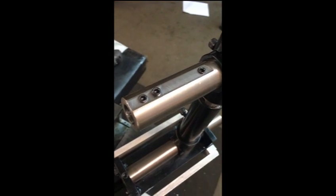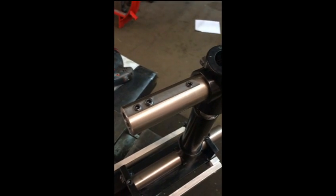That black dot is marked on the adapter, so the second screw holds the adapter in place. The other two screws go through a hole in the adapter to contact the holder that slips inside. That's how the adapter works and how these set screws were designed. You can use the first two set screws if you have a short cutter, and the longer set screws are for a longer cutter. Really only one screw is necessary — we just supply an extra screw to make sure it's secure.